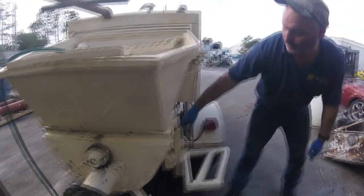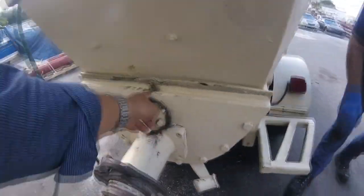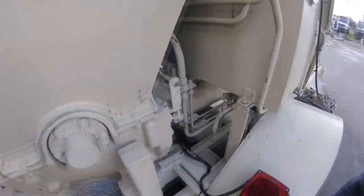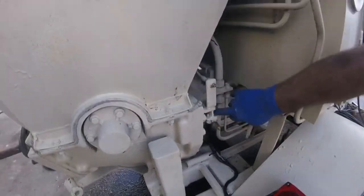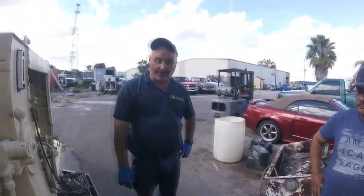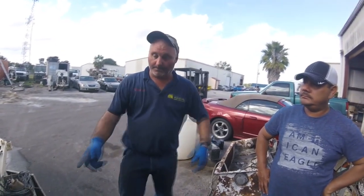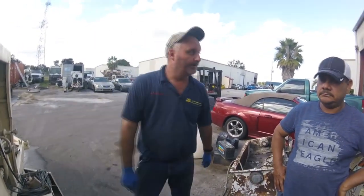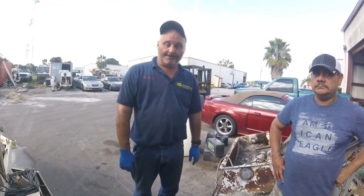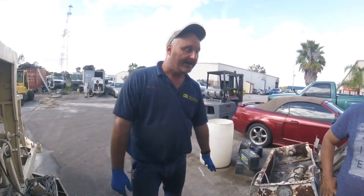Okay, so you've got five places to grease. One, two on the far side, three, your outlet bearing, four and five. One's for your shift lever, and the other one's for your inner bearing, right? And you're gonna do this at 50 yards. So when 50 pulls off and 60 backs up, two pops, boom, boom. Or at the end of the job. Because they're normally always pumping about 30 yards. They're doing swimming pools.